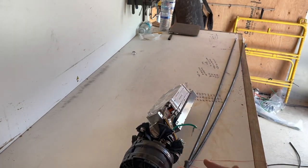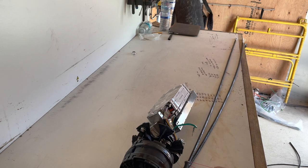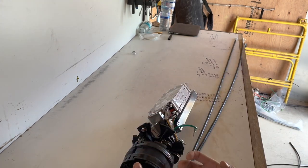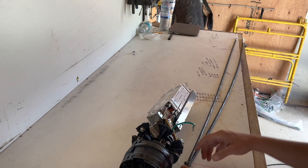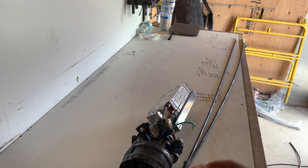Everything I'm doing, as you can see, is step by step. What I do to one cable, I do to the other one right away, so that that step is fully completed. Like, we started with the ring cut at the front, both cables ring cut. Second step was taking the top layer off to expose the actual rip cords to get into the cable. Did it for both cables. Pulled the rip cords, cut the rip cords. Organized the ring cuts at the front, pulled the rip cords down, organized the ring cuts down here. It's just every step I do to one cable, I do to the other cable at the exact same time.